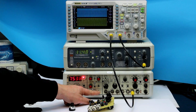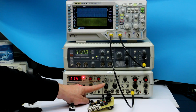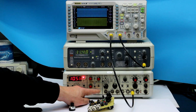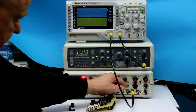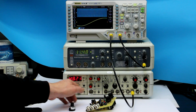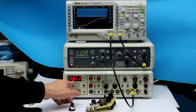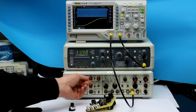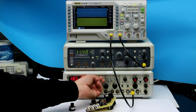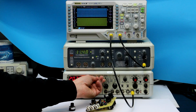So this is linear sweep, and this is only usable when your minimum and maximum sweep frequency are quite near to each other. But because you here have a sweep ratio of nearly 1 in 1000, you can sweep nearly the whole audio range, for example, from 20 Hz to 20 kHz. Let's try this. We are in the position 20 kHz. So let's set the lowest possible frequency to 50 Hz. That's not 20 Hz. That's because the MAX038 does not exactly have 1 in 1000. I think it's 1 in 300 or 1 in 600. So we leave this at around 50 Hz and set the highest frequency of our sweep to exactly 20 kHz, as well as possible with a 10-turn pot.